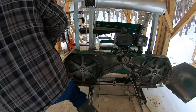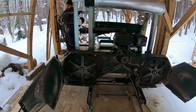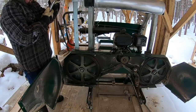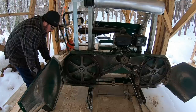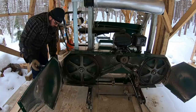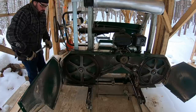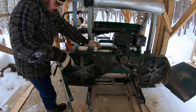And once that blade is flush with the back of the band wheel, as I said, I think I'm in good shape and I'm tensioning up the blade in order to try it out. And this is a 2017 HM130 model by Woodland Mills. It specifies 25 foot-pounds of torque, and that's what I applied here for tension.